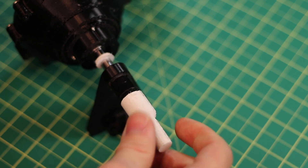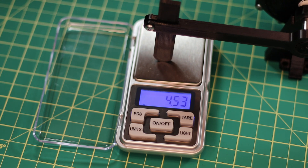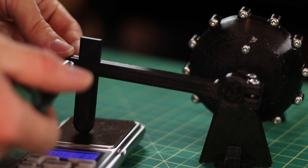Once I've put it on, you can see that when I turn the other side slowly, it does read a little bit of force on the scale. To extract a useful torque value, we need to multiply the grams by 9.8 — because force equals mass times acceleration, with 9.8 being the acceleration due to gravity. Then we multiply by the length of the arm, which is about 10 centimeters. I keep forgetting to fix my hair between shots so it gets progressively worse as the video goes on.